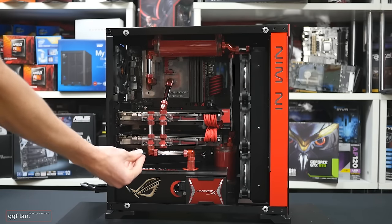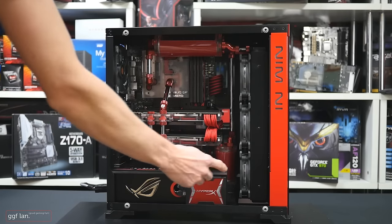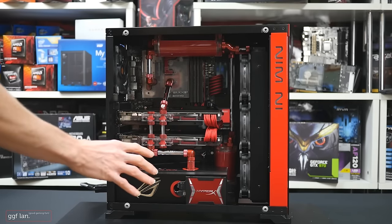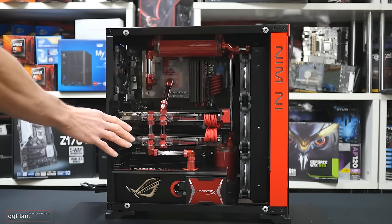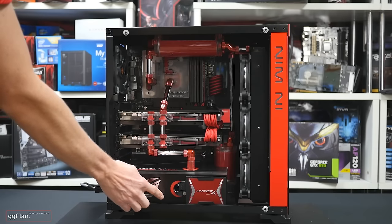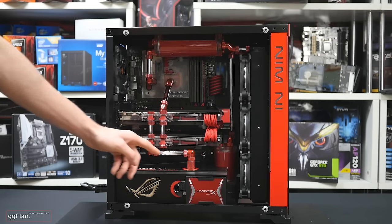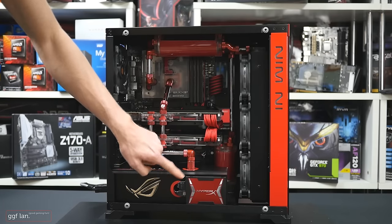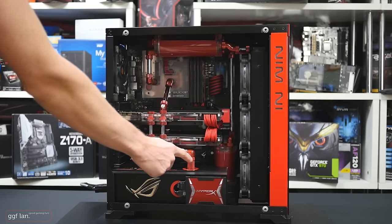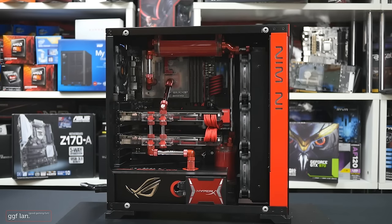The middle layer is a clear piece of acrylic, about four or five millimeters thick, and then there's a top two millimeter piece of plexi painted black. By adding them both together and adding an LED strip on the clear one — once you sand the edge — you get a nice LED ring along the side. The top black piece finishes it all off.